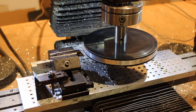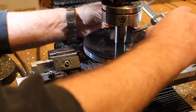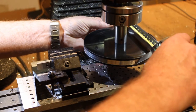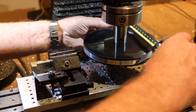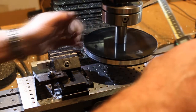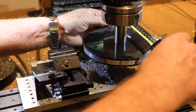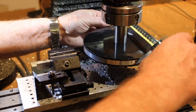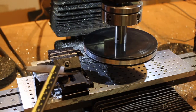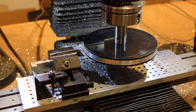The job just finished up. Let's take a final measurement here. That's 5.896 inches, which is exactly where it's supposed to be. So that's the final two blanks that needed to be cut. I'll take them off here, and then we'll change the setup over and start cutting some teeth.